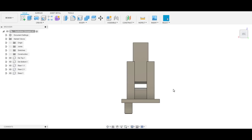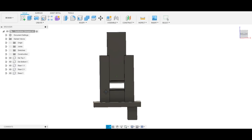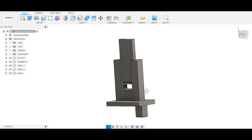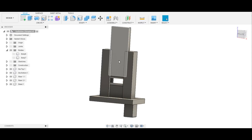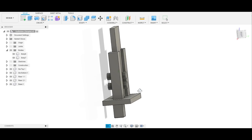Another way of making a guillotine uses a front and back plate rather than this rail or riser approach. That approach will allow you to use slightly lighter materials, but it limits the thickness of dies that can be used. With this design, you can put in big, fat, wide dies and they go in and out really easily.